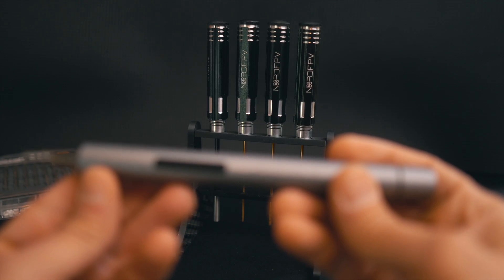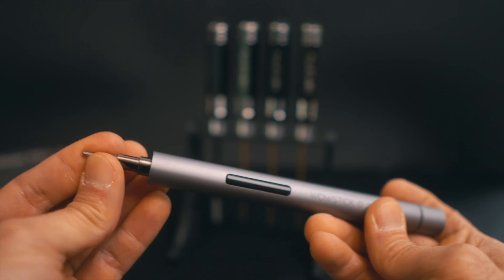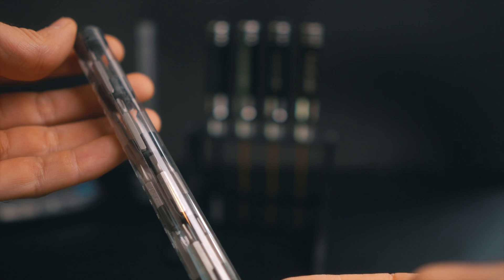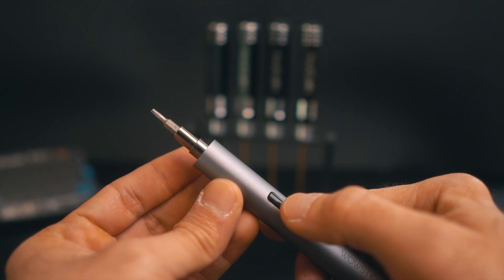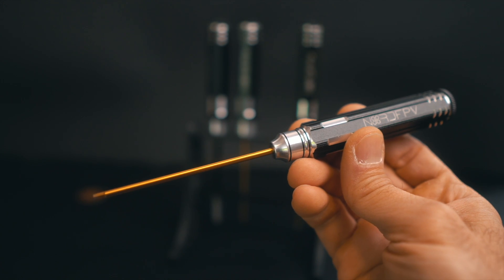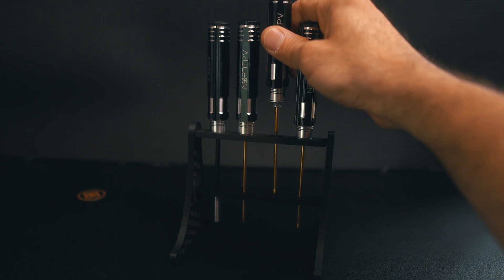When it comes to screwdrivers, a lot of people might be tempted to use an electric screwdriver, which is a tool and it's good, but it has two problems. One is the bit-changing issue I was mentioning. If you are working with several different screws, it's a pain to keep changing them. Number two, the torque on most electric screwdrivers is not enough for bench work. So I go with the traditional screwdriver — good quality, so it doesn't strip or break after the second or third use.